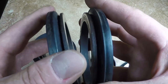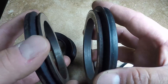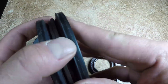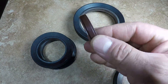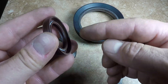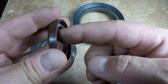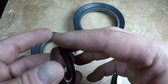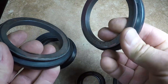Once in place, this can handle abrasion and other conditions and prevent oil from leaking. This is a very good type of seal because if it goes bad it doesn't damage the shaft or the housing where the seal sits. They couldn't just use a regular seal because, for example on a bulldozer, sand or dirt could get between the shaft and the seal and wear the shaft. With a regular seal going bad you also have to replace the shaft, but with this one, when it goes bad you just replace the seal.